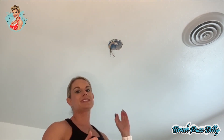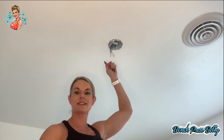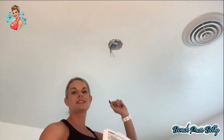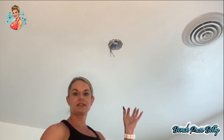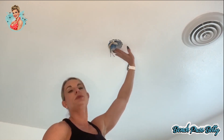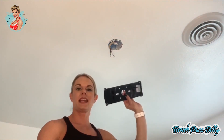A little bit of the basics: if you have a new construction, or like what we're doing where we're house flipping, you will just have the outlet box here with the wires exposed. If you're swapping out an old ceiling fan for a new one, you'll want to disassemble the existing ceiling fan starting with the bulbs and shade to take it down. And you'll want to remove the existing base plate, because chances are the new ceiling fan will have its own base plate and no two are often alike unless you buy the same model.